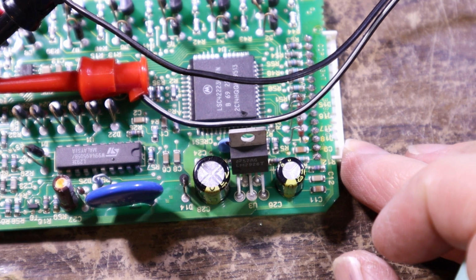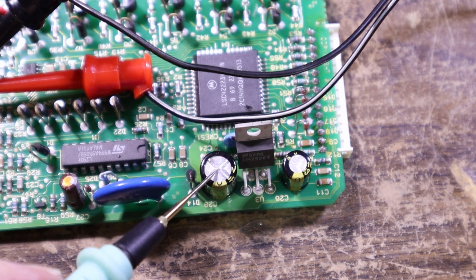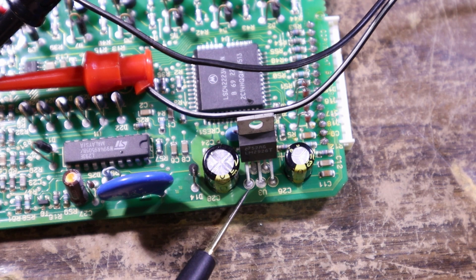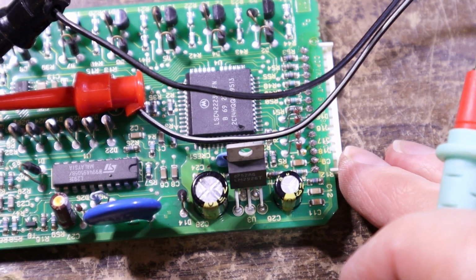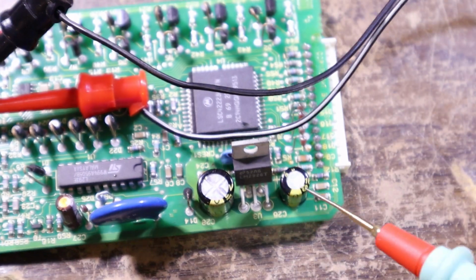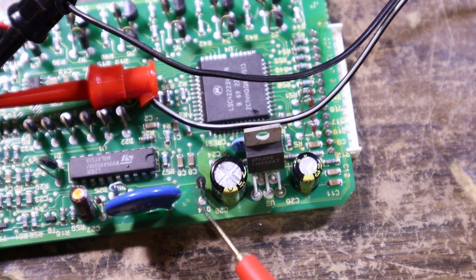Yeah. One thing I did, because it actually does have a lot of protection against reverse polarity, so it probably wasn't that. It probably was just the cap was old and became a short. There would have been a lot of current go through this diode. The battery in goes through this diode and then to the regulator. Yeah, and that capacitor is on our input to the regulator. So it may have been an over voltage, or it might even be ripple. Like ripple from the alternator would really upset a capacitor like that. So I will tell him to check his charging circuit, but keeping in mind the other caps are okay. However, this cap's on the output, so it wouldn't matter. You wouldn't see the ripple there once it had gone through here, I suppose. Would have thought that the diode would somewhat rectify that.